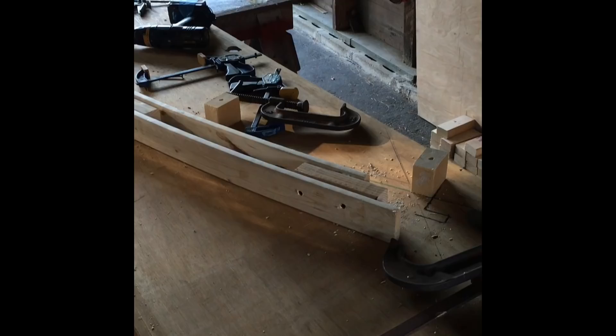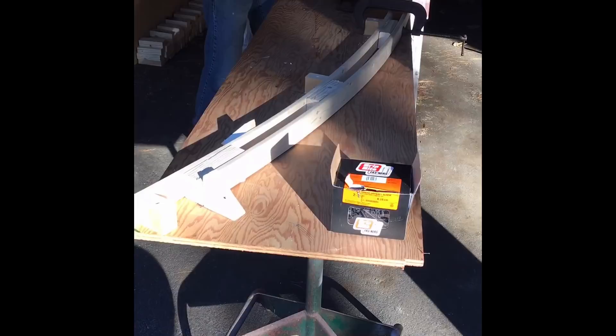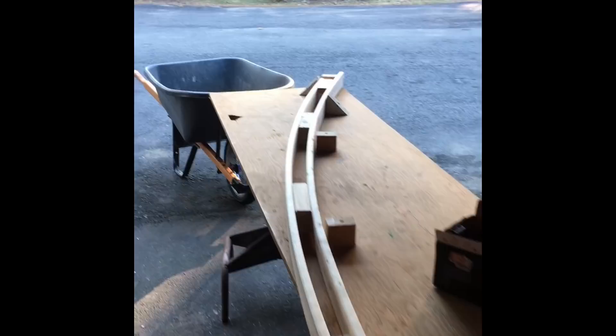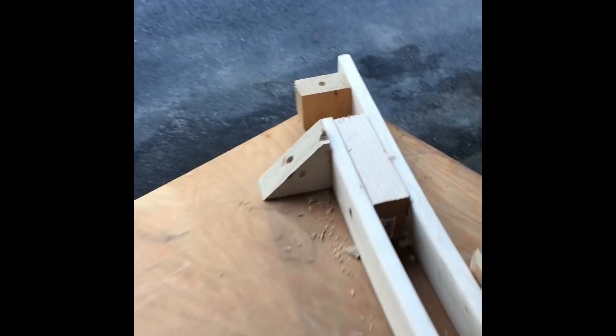So there it is, all done. Total cost of this arch is probably about $6 — I think I paid $2.20 for each 12 foot length and a half a two by four. I need to make 12 of them so it's going to cost me $72 to finish the arches. That space in between is made for a two by six frame to set it on, and you can also put a gusset in there if you need to help stabilize it.